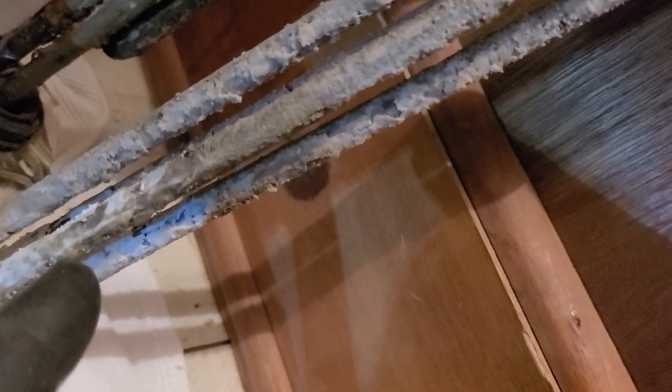All right, we're looking at a hot water tank. I'm going to show you what we got here — these are the elements. I want you to see how corroded and burned out they are. They're 4,500-watt elements. This is the lower one — could barely get it out. That's the upper one. Look how corroded that is.